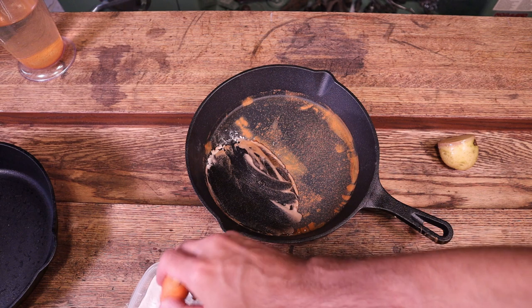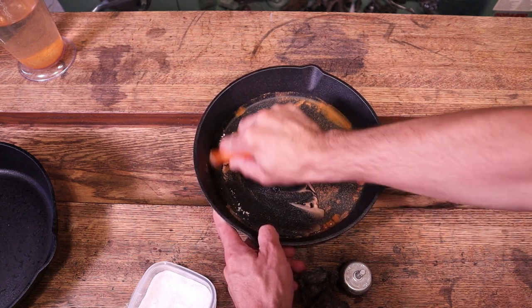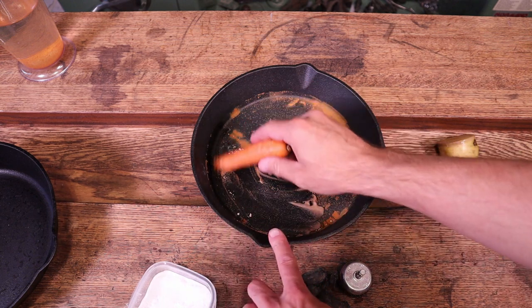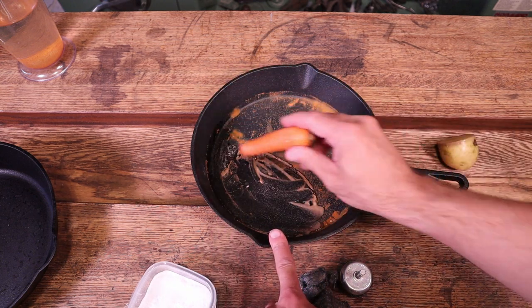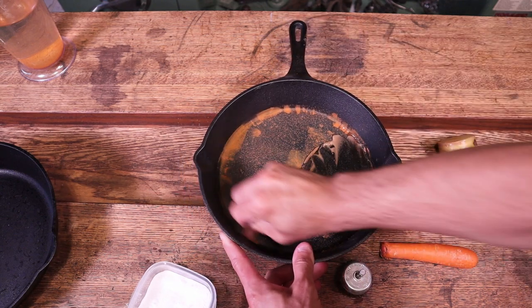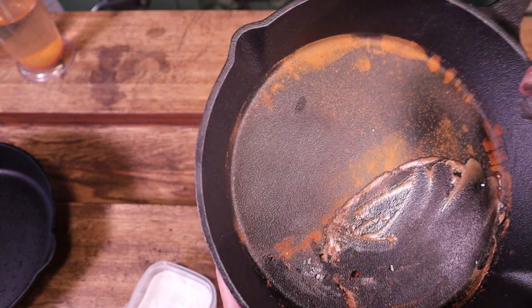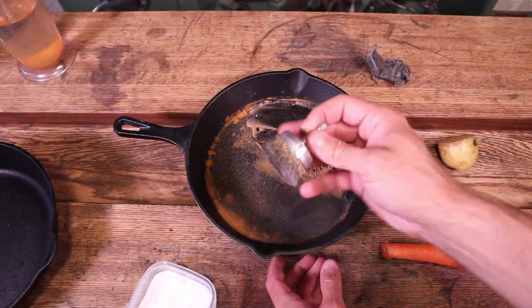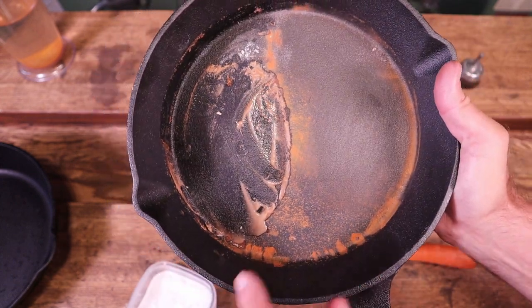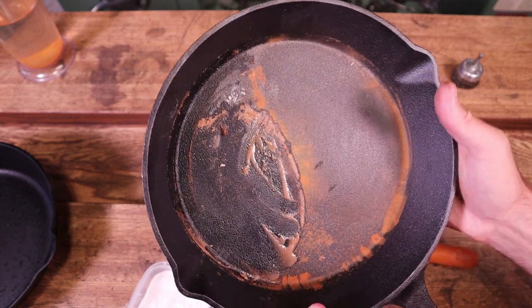That worked really well — a little nook and cranny tool. I'm surprised these work really well. Because it kind of conforms to the surface, and this is a really rough surface, it seems to get into all those little spots that you might have trouble reaching with sandpaper. I also have some steel wool, which does a good job as well, and a little wire brush too. It looks like all of those methods worked really well. I've never tried the potato or carrot method before but I had read about it and it seems to work pretty well for this type of rust — very light surface rust, so it's pretty easy to take off.